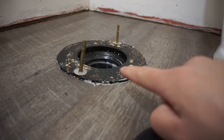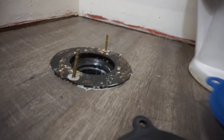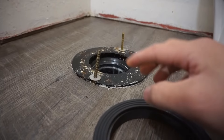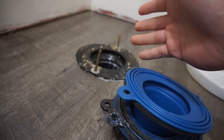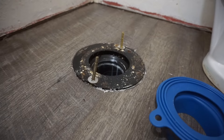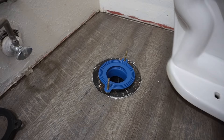You need to determine whether your toilet flange sits flush with the floor, a quarter inch deep, or more. Since mine sits above the floor, I won't need the toilet gasket riser — just the rubber seal. If your flange sits a quarter inch deep, you'll need the riser. If it sits more than half an inch deep, you'll need to double it up with an extra seal.